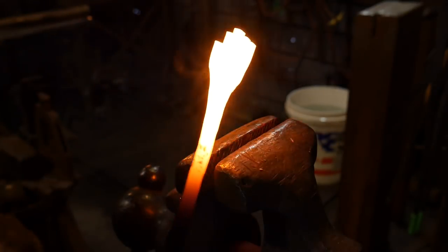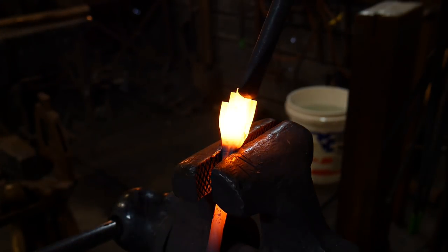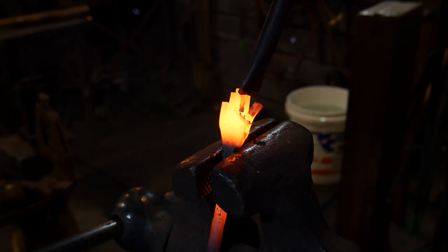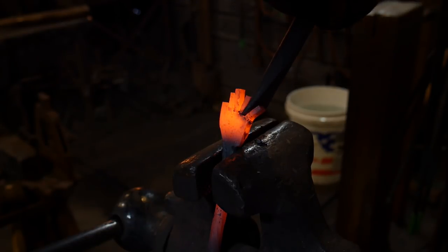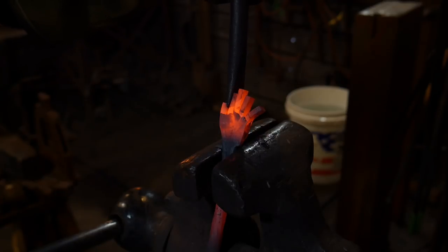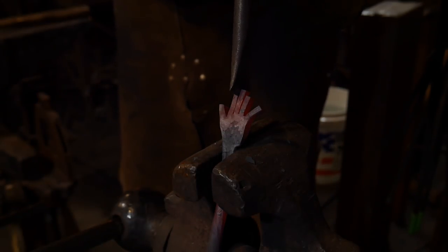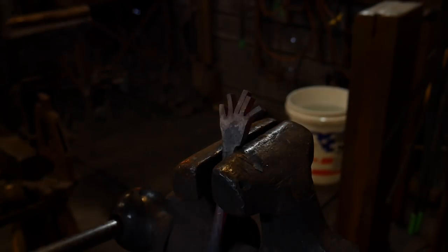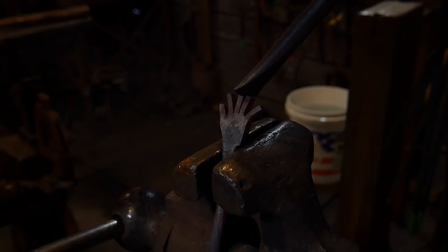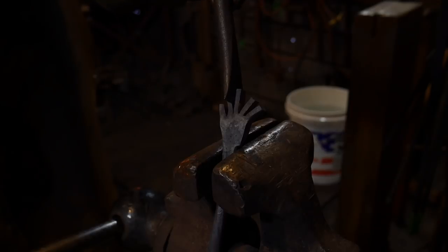Okay everyone, so here we go. We're going to get this locked up in the vise — hopefully everybody can see that just fine, it's got a nice bright color temperature to it. We're going to start with the pinky and drive a slitting chisel down between these. The ideal here is we just want to take and drive these and get them sprawled out. We'll go down to the thumb and get that all sprawled out too. We're going to deepen the cut slightly to remove some of that saw-cut look. Just take your time with this and get everything sprawled out from one another, and dress up the bottom of the saw cut.